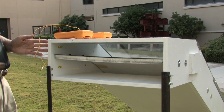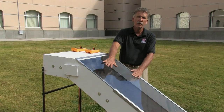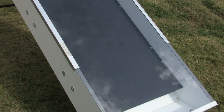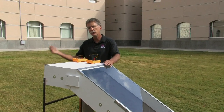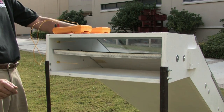The room provides the cool air, which comes in underneath our black metal strip here, which increases the solar absorption. The cool air falls to the bottom and is pulled up as hot air rises, creating a circulation that pulls cool air from the room and brings warm air back into the room after it's been heated through the device.